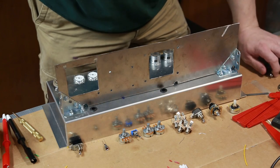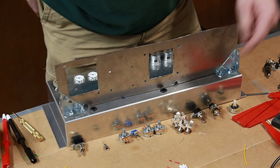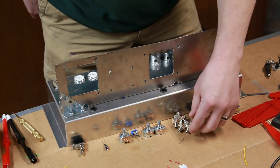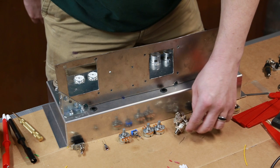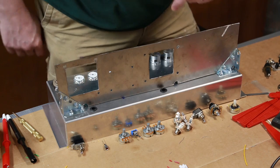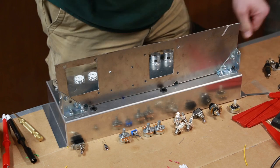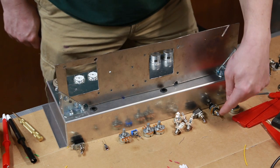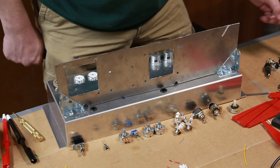What I'm going to focus on here: I'm going to have a power switch, a light, I've got a top cut, this is the brilliant switch, these will be the normal and tremolo volumes. My four input jacks will go here. I'll have the tremolo high-low and the normal high-low. I have a switch here that will be the vibrato tremolo switch. This will be the depth with the depth pot — it also has a push-pull potentiometer as well as a switch that will be used as part of that.